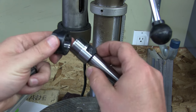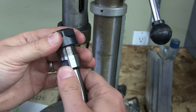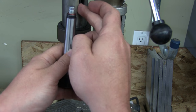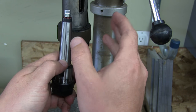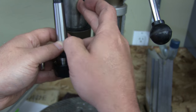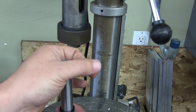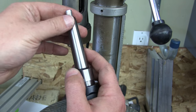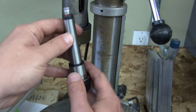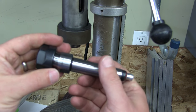Relatively quick and painless — the bris of the misshapen Chinese dingus end, quickly and easily dispatched with moil-like efficiency. I also put a stud in here, because this is a Morse taper too. Morse taper does not hold when there's loading this way — it shakes loose. What we need to do is heat the fuck out of this. Normally on a milling machine there would be a drawbar that takes the male end and jams it into the female socket. Unfortunately in this case we don't have the drawbar and there ain't no room for it. So what we can do is heat this up — that differentially expands it — we jam that in, and when it cools, she's in there for good or worse.